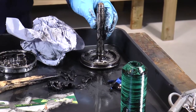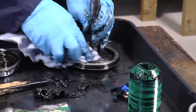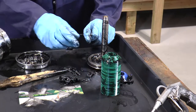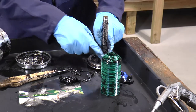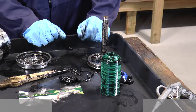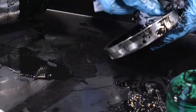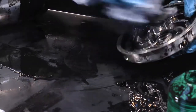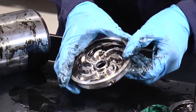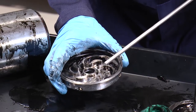We can now wipe with a clean cloth — if need be a little bit of lubricant or clean oil, just to help the process. There's no need to clean individually the bowl discs and they don't even need to be removed unless the sludge has gone under the distributor impeller or has gone into the discs themselves. We now need to clean the top turbine, give a wipe round. One very important factor is to check that the nozzles aren't blocked. One of the best ways to ensure these are clean is by using a source of compressed air.